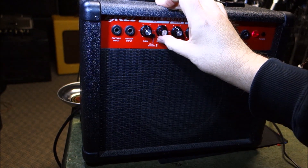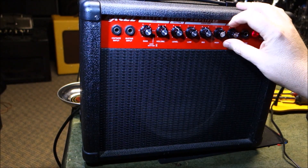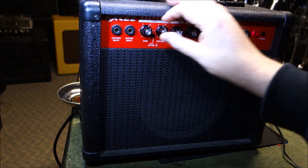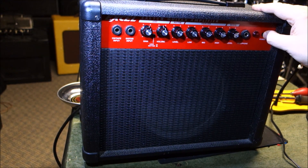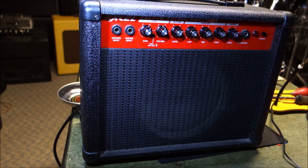We've got two gains — high gain, low gain. High gain makes noise, that's kind of to be expected. But that's that startup sound — yeah, that's not good. Amplifiers shouldn't do that. Solid state amps giving a hearty thump when you boot them up is kind of normal — you get that poof — but they don't do that when they're healthy.